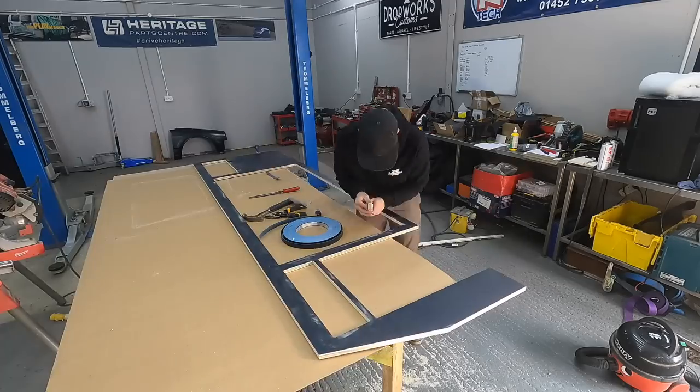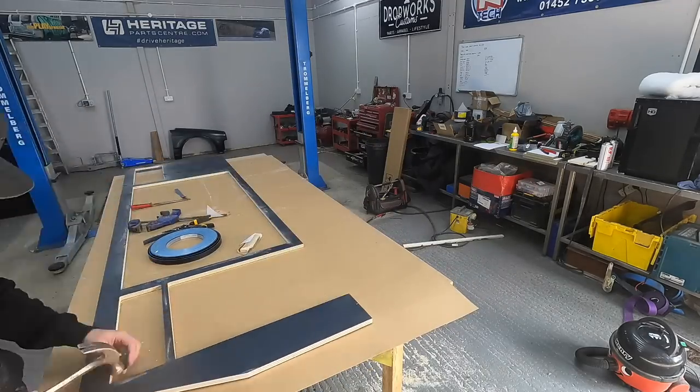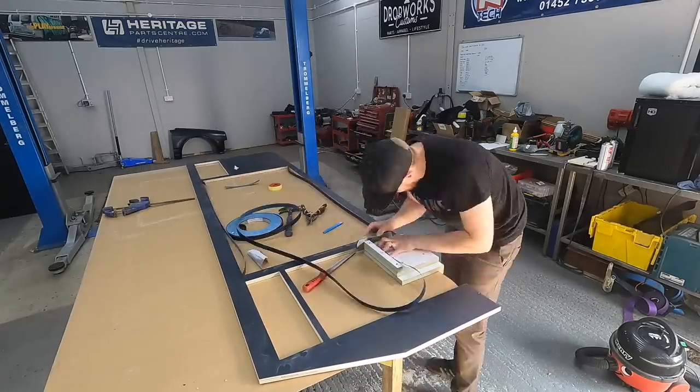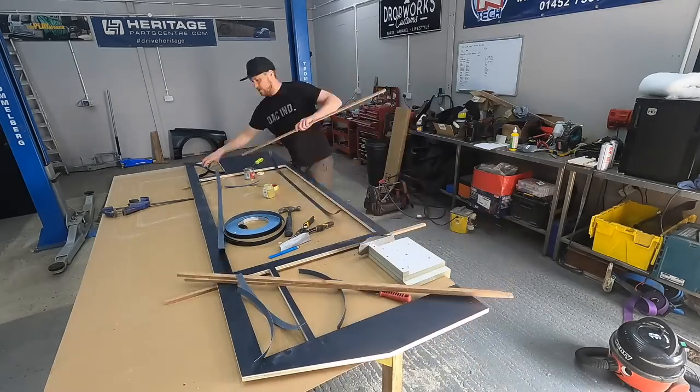So like I said, first thing to do is go around, square all the corners off, and then we're going to go in with a bit of sandpaper and just clean the burrs and tidy up the edges from where it's been CNC'd. This one part was tabbed, so there are little bits that we need to clean back. We're then into cutting the edging.